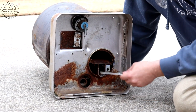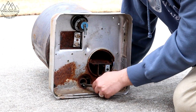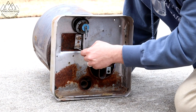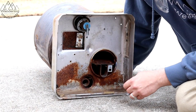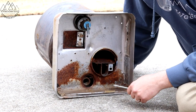Let's go over it a little bit. This particular one is steel. Here you'd have your anode and your drain plug down here. This is your burner here. I think this is some type of thermostat stuff up here. And this is your pressure relief valve. I told Jean, just hang on to the good parts — I just want the tank. Let's slice this sucker open.